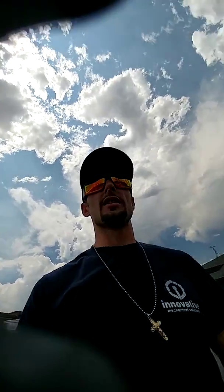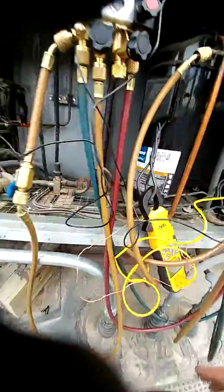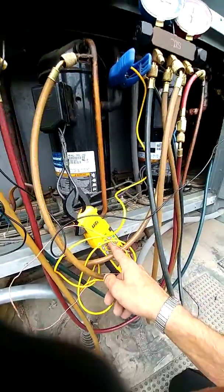They have to run water on the condenser to keep the condensing temperature down. What I found was non-condensibles in circuit 2, and I'll show you how I did that. It's a super hard diagnosis.